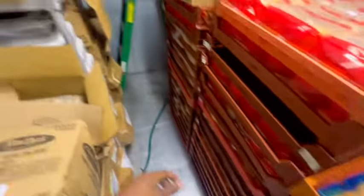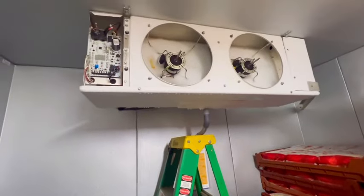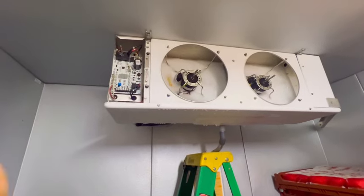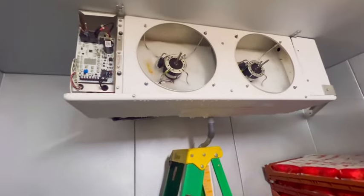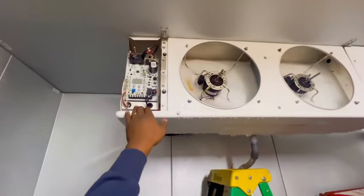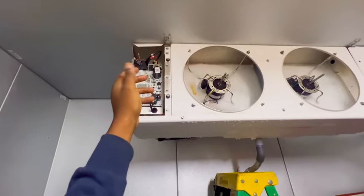I'm gonna speed up this process. They said they have been turning it off, but if it wasn't able to pump down the unit would still be running anyway, even if it went into defrost. I'm gonna wash all this up and start changing the board out. I'm gonna actually unhook all this because I already got the power off, take some pictures, and get access to that valve so I can change it out.